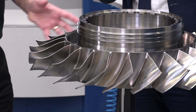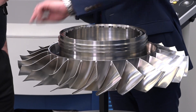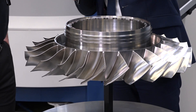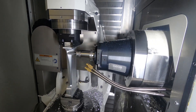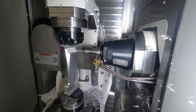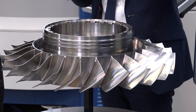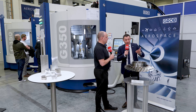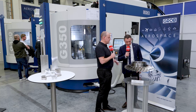The areas that are particularly difficult to machine are certain internal shapes, but also the foil itself — the geometry of the foil and the root of the foil. We have to make sure all of those pieces run within a case without hitting it at very high RPM. It's also related to the force that keeps the aircraft in the air, and nowadays zero emissions is a big point, so noise reduction and precise surface finishing are also very important.